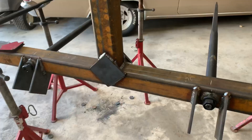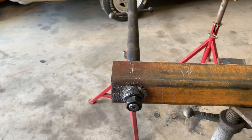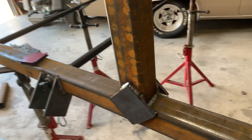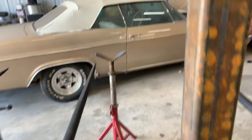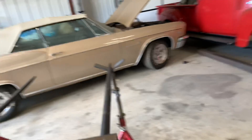Following day now. Before I quit yesterday I got these support plates — not gussets, just small support plates — some 3/8-inch plate, a little thick but welded up to give the riser some extra support. Next I'll weld on the tabs up top, pre-drill the holes, then weld them, drill the holes below, clean these up, cut the corners off, and cap the ends. Getting close.